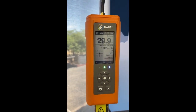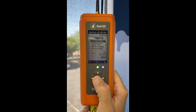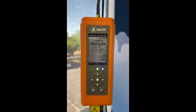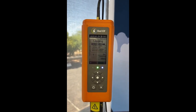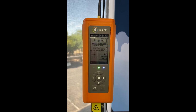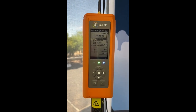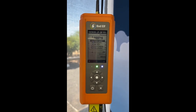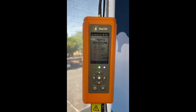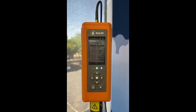Now let's say I would like to take a point. You can do that a couple of different ways. From the GPS screen you can hit the center radio button. By clicking that you'll see a window pop up for logging, and you can either do an instant point — a one-second observation right where you are — a timed point for a pre-determined amount of time, say 15 seconds, log raw GCPs or ground control points (say you're a drone operator collecting data for photogrammetric processing), start a track log for a breadcrumb trail, or start a new project — basically a data repository bin you can organize by day or task.